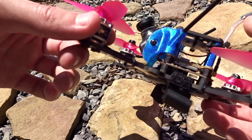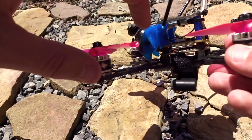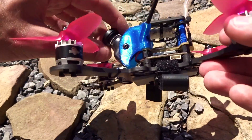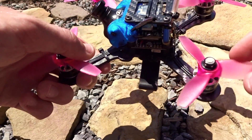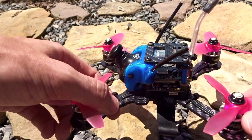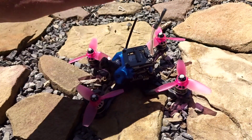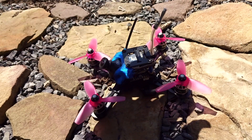I didn't have any issues with durability — I've crashed this a ton. It's just a flight controller, right in there protected pretty well. It doesn't have a built-in OSD but it does have KISS telemetry on the ESC, so if you hook up an OSD — I have a Piggy OSD to put on the back of this camera — I should be able to tap into the TX2 pad or similar and get the KISS telemetry displayed on screen. I won't be showing flight footage in this video but there are links below to videos that include DVR footage.